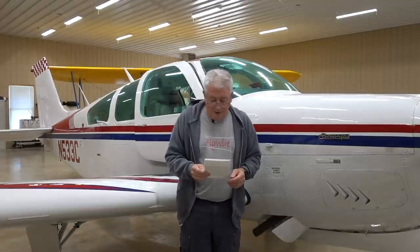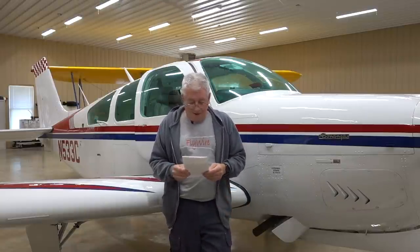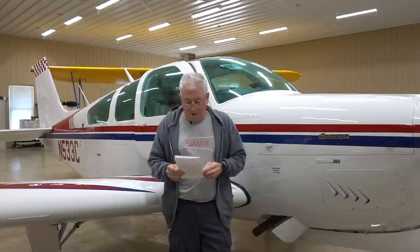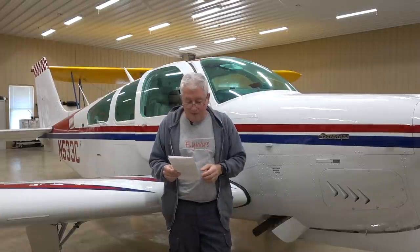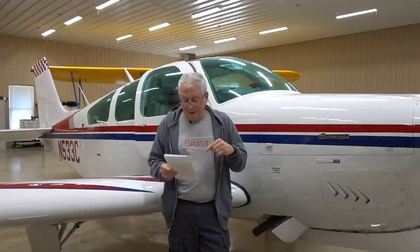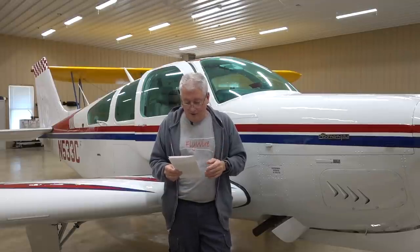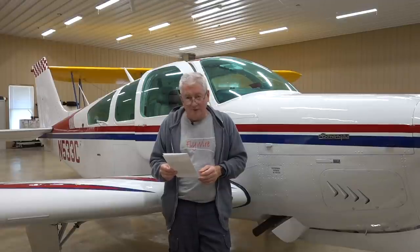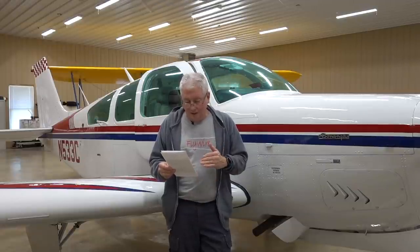For noise, there's an app for everything, right? On your iPhone there's a decibel meter app available, and I recorded it. We also had an outside camera and recorded the decibels as the airplane passed by. For the Mack prop, inside it was 96 decibels for the takeoff and outside it was 134 decibels — which is pretty loud, almost rock concert loud. For the MT prop, it was 125 decibels outside and 92 decibels inside. That's about a 10 decibel difference, which is almost half the noise level.